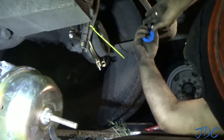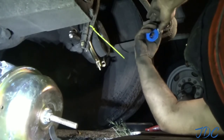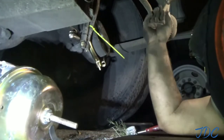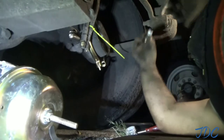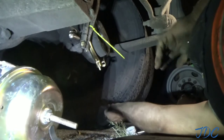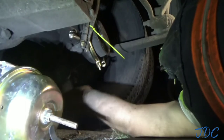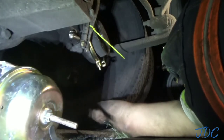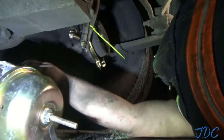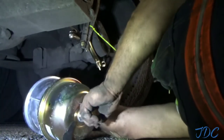This truck here has a lot of air leaks. You had an airbag that was bad on the suspension, and then he had two cab airbags that were rotted. They were both leaking. There would be enough where you could spray a little bit of soapy water on there and it'd bubble up. He's got this air chamber leak. The fan clutch had an air leak. The hose that goes to the solenoid, I'll show you here in a minute, also has an air leak. So with all these little air leaks, his truck can't build any air pressure.